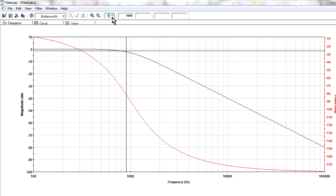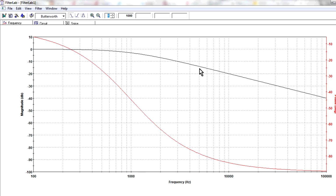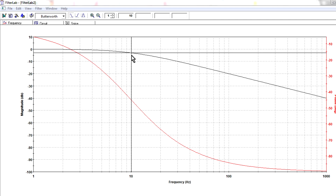But if we use our first order RC filter, which we've got, it's only attenuated by 1/10. So we're not going to filter out much if we set our cutoff at 1000 hertz. If you're trying to filter out a 10 kilohertz frequency PWM signal with a 1 kilohertz filter, it's going to do a pretty darn poor job of it. It's only going to attenuate the 10 kilohertz ripple by 1/10. It's hopeless. 10%. Unbelievably hopeless.